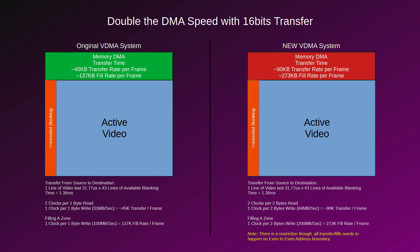One of the beautiful aspects of having a 16-bit bus with the SRAM is that for the same clock cycle you get two bytes instead of one. The DMA controller is where the benefit will be seen immediately — some users will be pleased to transfer twice as much data in the same time. However, there is a caveat: you must always do transfers from an even address to another even address, because putting in place logic to deal with different byte-word placement would be very complicated, and going from even to odd or odd to odd is a nightmare when you're not transferring byte-to-byte.